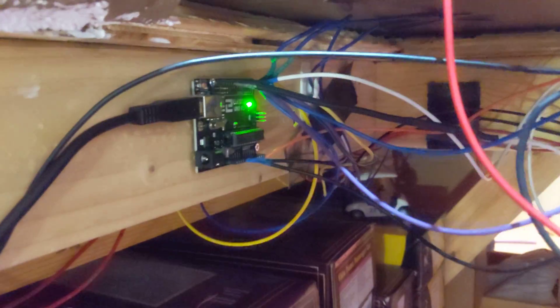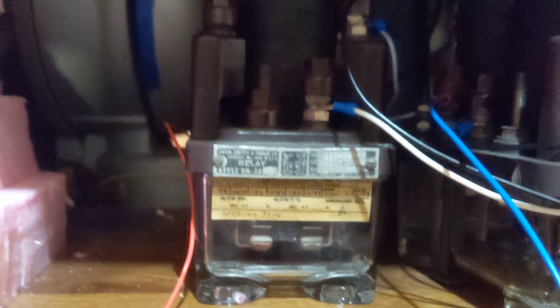Basically what happens with our train activation is: we send an electrical pulse to pick up this relay, which completes the circuit to our railroad crossing microprocessor. That tells the bell relay to pick up, which makes the bell go off, and it picks up this relay to tell the MTH crossing to flash. If the train went the other direction, we pick up this relay to control the semaphore. Our train is nearing the detection point — I did put a piece of tape over the bell to help mute it, so it's not as deafening, but it's still pretty loud.